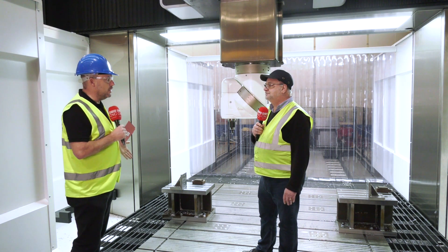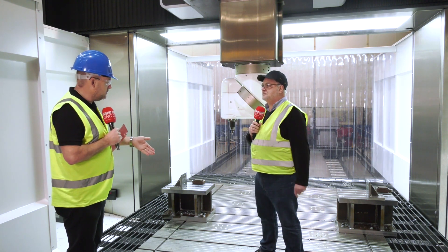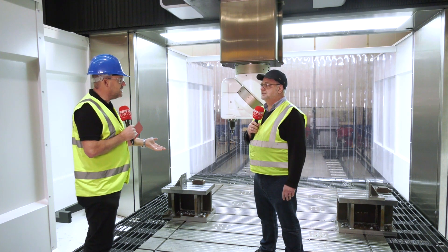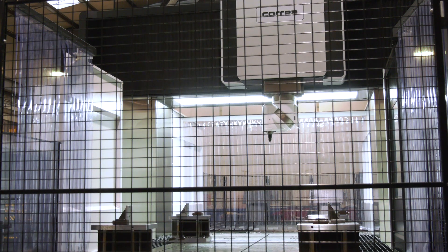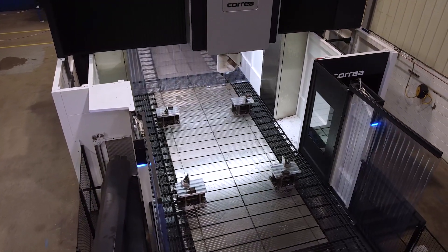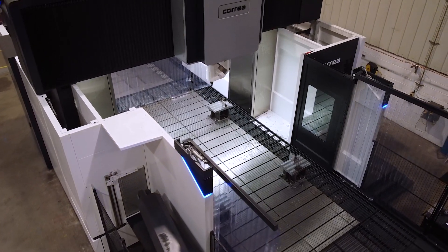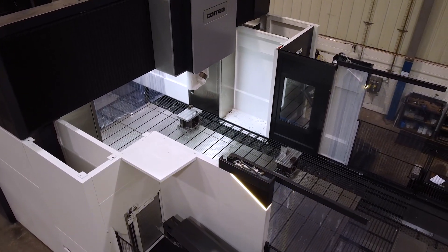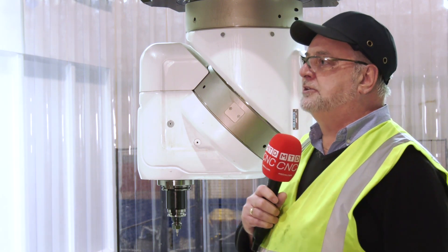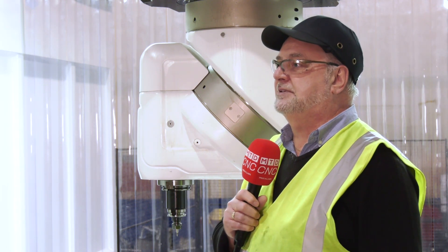Another key point is the rack and pinion for table movement. This table moves at 25 metres a minute — incredible given it can carry 25 tonnes. The machine weighs up the load on the table and builds up to speed gradually rather than setting off immediately. The rack and pinion is a far better mechanism than a ball screw for axis travel at those speeds, particularly for backlash. Linear scales on that axis also maintain accuracy.